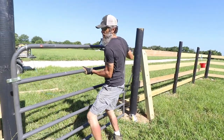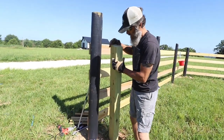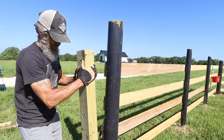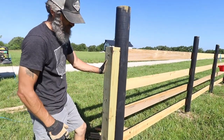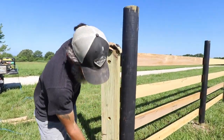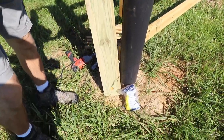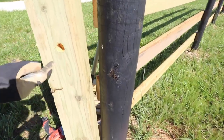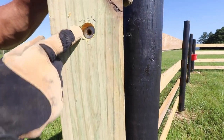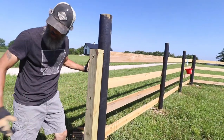So it's too late to fix it the right way. What we're going to do is use some of the leftover four-by-six posts that I got for the shelter and put these up against the posts like this. I bored three holes in it, drilled through into the post a little bit, then bored a wider hole so I can get the washer in there. I'll put lag bolts in and lag bolt these to the post — that will close this gap.